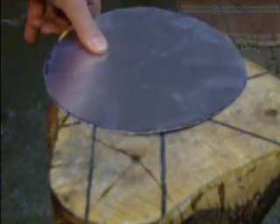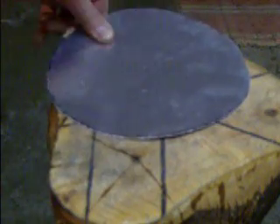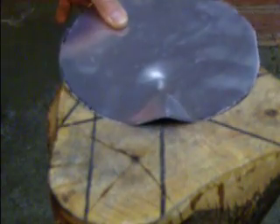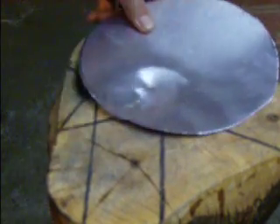I'm going to take the metal, get down into the middle of the cone. It gives me a tuck here. I'm going to take the legs of the tuck, keep them in contact with my cone depression, and work my way around the metal this way.